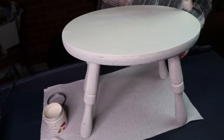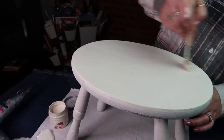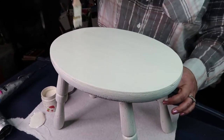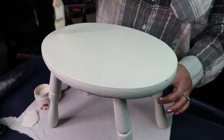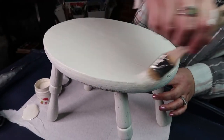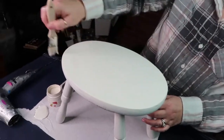That's not a given — it can not do that, but in this case it did just a little bit, and because I was looking for that shabby chic farmhouse look, I'm completely okay with that. If I wasn't, I could just sand it back down and apply another soft, even coat — and it's that simple. So make sure you're going back and forth with even strokes. Once you are completely covered, you might need to add a little bit more, but make sure you go back and get that even layer so there are no drips. Even is the word of the day.